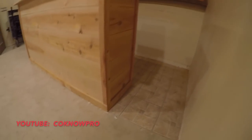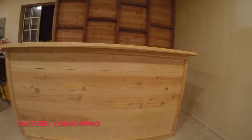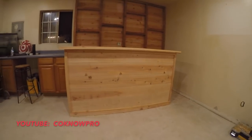You see how the back, it sort of looks like pallet style, and then the front, it's like pallet style, but a lot cleaner than using pallets. And this is really strong and it'll last forever. But down there on the left side, what I do is I put 2 pieces of angle and some anchors, and I anchor it into the concrete there, so that way that left side doesn't move. And then it's only attached to that pony wall back there, a couple screws on the top of the pony wall, and it's really secure. It's not going anywhere. But there it is, everybody.